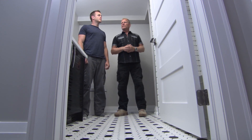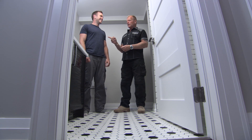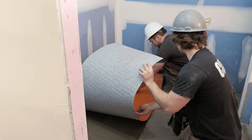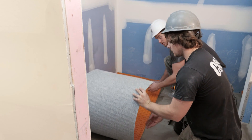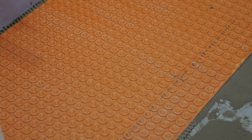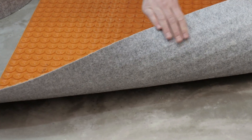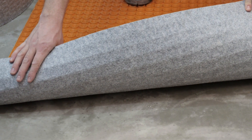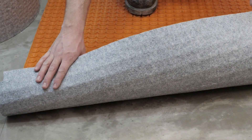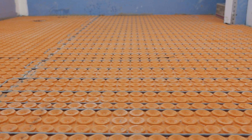Mike, you did a great job on this bathroom. Thanks, man. It's actually Ditra Heat Duo — Ditra Heat Duo. This is the uncoupling layer that we've trusted for years underneath our tile. It's designed to stop the cracking of the tile and the cracking of the grout. It gets its name Ditra Heat Duo because, in addition to adding that thermal break for warming the floors over concrete, the thicker fleece backing actually provides sound control when used in multi-story concrete construction.